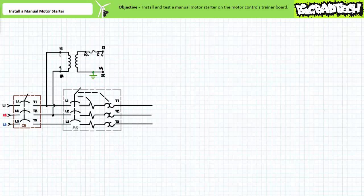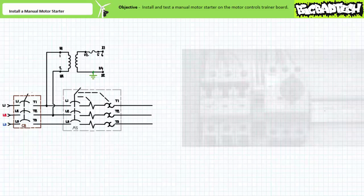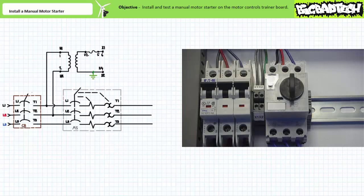Similar to a circuit breaker, the manual motor starter also serves to protect the circuit from high current events associated with short circuits. Warning — do not try this at home; there are additional circuit protection elements in play. Here's the circuit breaker and manual motor starter hooked up to a contactor wired such that phase L1 and L2 go phase to phase with no current controlling element in between. Ordinarily, the closure of this contactor would be a bad idea under full sail. However, the moment the phase-to-phase event occurs, both the circuit breaker and the motor starter recognize the high current event and both simultaneously open up to save the day.